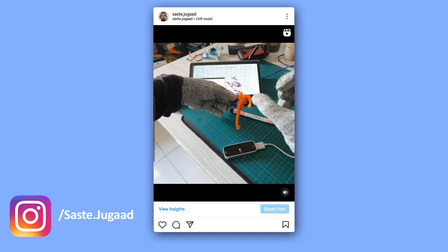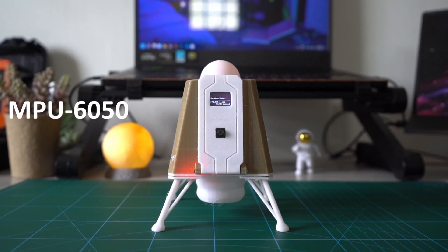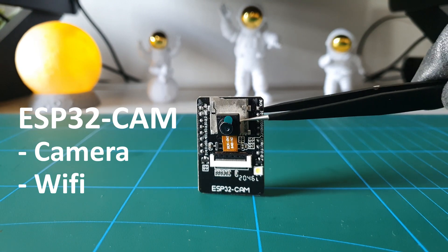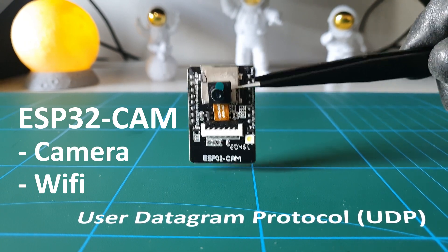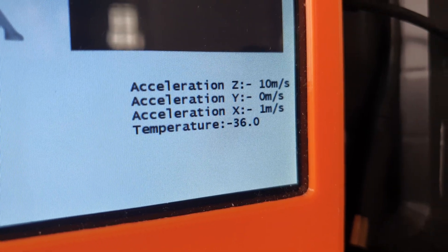We actually have two different programs — one for the lander and one for the control center. The lander's main work is data collection. We are using the MPU6050, and since it has its own sensor library, we just have to declare a few variables and it's done. In our microcontroller, Wi-Fi and camera are already built-in, so we don't need any extra sensors. For video and data transmission we will use UDP protocol, which is very easy to implement. We just need our Wi-Fi router ID, password, and the IP address of the control center, and that's it.